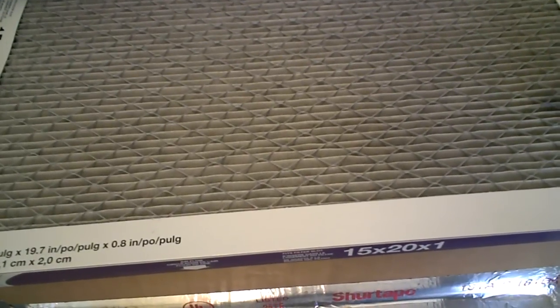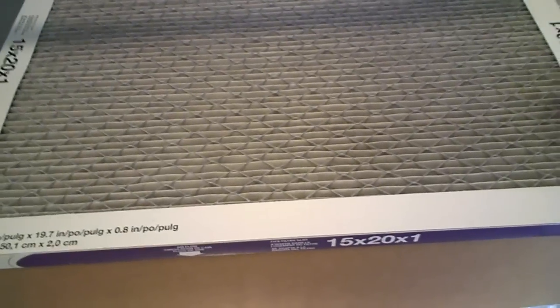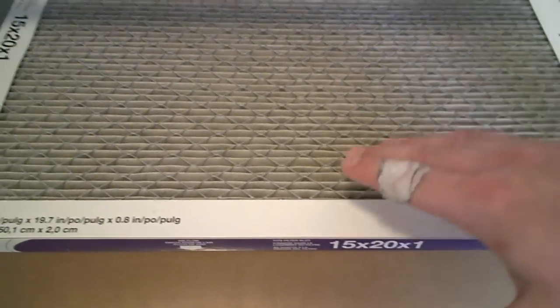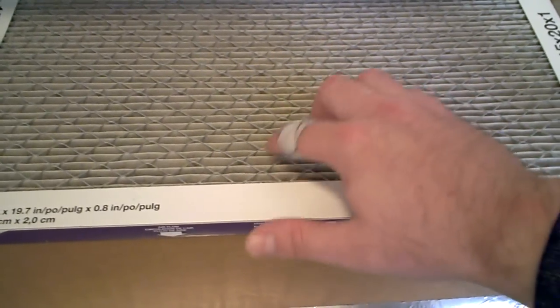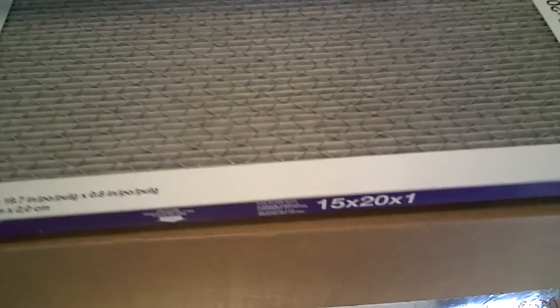This filter is actually wider than the box. You could try to match up a box and filter at the same size, but if you can't, just take a piece of metal tape and put it at the margin where the box meets the filter, so it still has a flat surface. Otherwise there's air going in between the filter and the box and you're not getting a really tight seal. Now it wants on there like a magnet — that's the first problem I've solved.